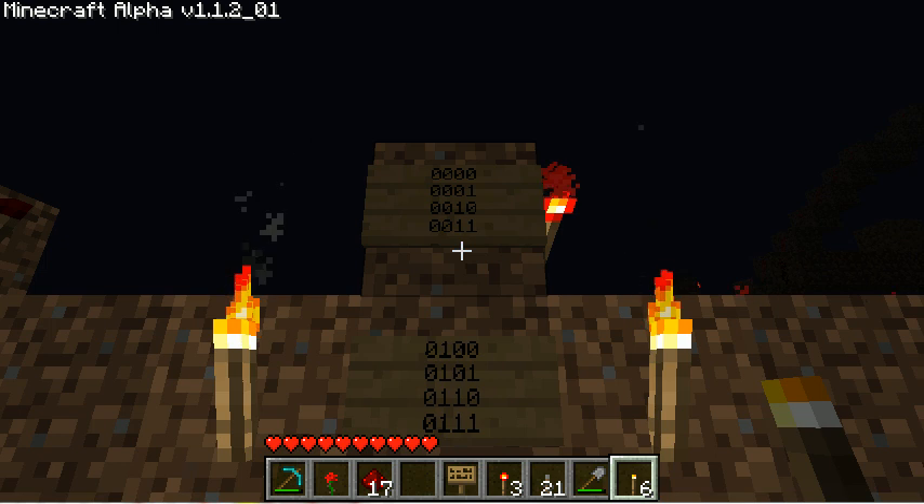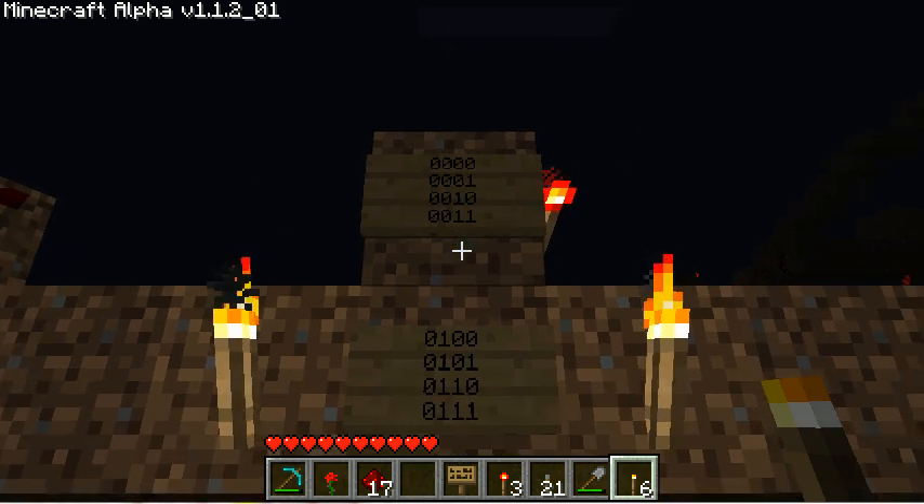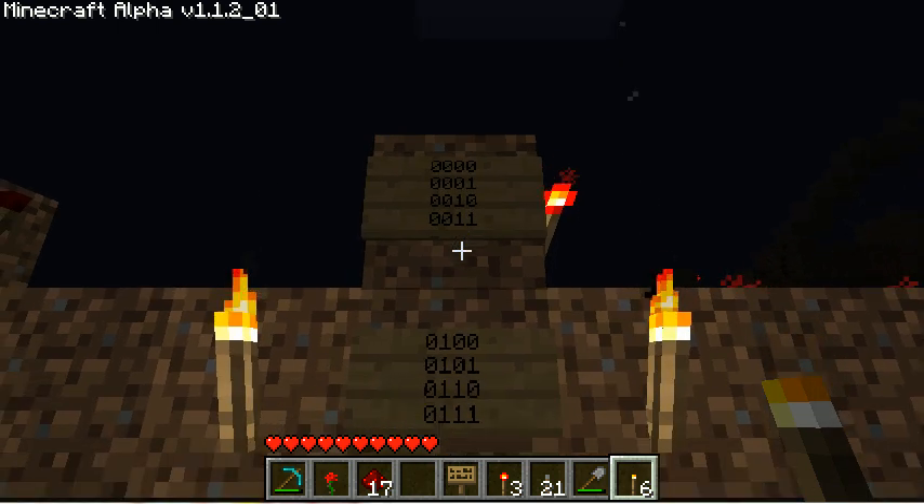to send a quick on-pulse to the input of the first of the two flip-flops. As you can see with binary numbers here, every time the one position goes from 0 to 1 to 0, the next position higher goes to 1. Once it goes from 0 to 1 to 0 twice, the second position goes back to 0, meaning that the third position goes to 1 because the second position has gone from 0 to 1 to 0, and so on. So it continues to loop that way.